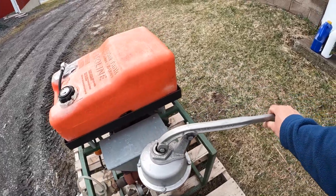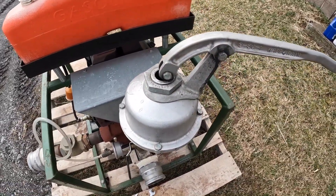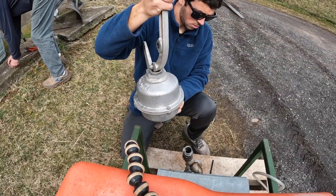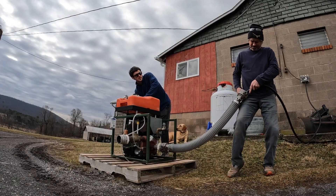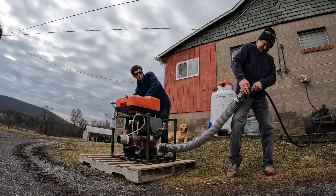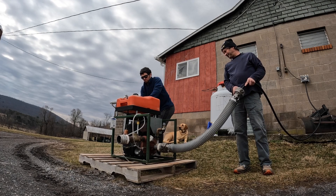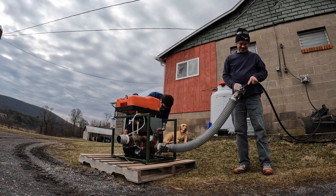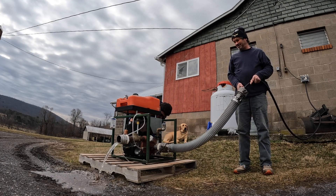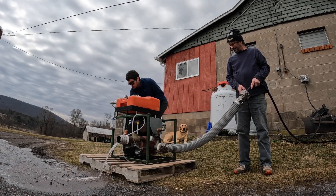The first thing we got to do is take off this arm here, or at least loosen it, so we can lift it up and then spin this head off. Why won't that open? I know I'm gonna get a bath here. Might have to choke it and flip the kill switch on. Look at that muddy water coming out. The pump might have some dirt or debris in it, so the first thing we want to do is run some water through and flush that out.